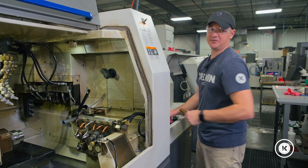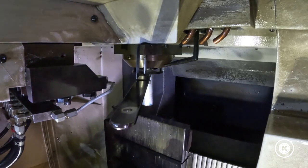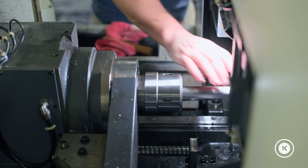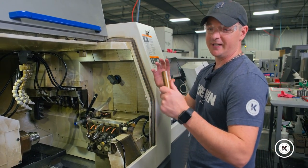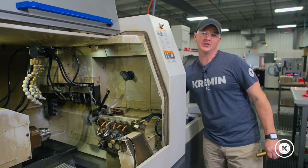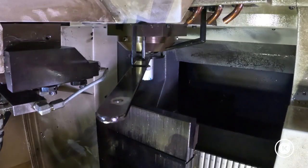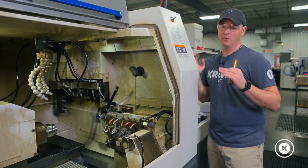At that point in time, I will take a piece of brass and what I'm looking for here is resistance as I pound backwards. A very light tap shows me that my guide bushing is very loose and material slams back. So from the backside, I will start adjusting by hand and slowly tightening the guide bushing. It's easier to get this going forward. If you don't get it right, you can just back it off, but then you're starting all the way back over. Give it another little tap — it has a little bit more resistance. I don't need to turn it as far this time. Another little fine-tune adjustment, then come back out and tap the material. I go as little as possible because it is easier going forward than starting all back over — so little adjustments will get you further in the long run.